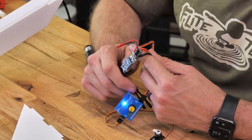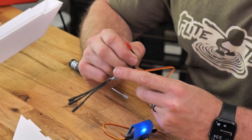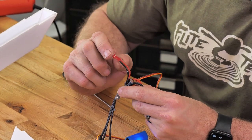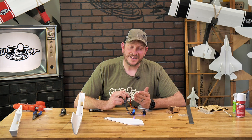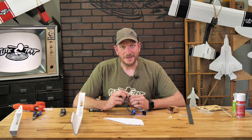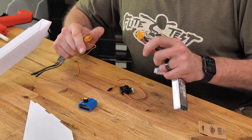Also, if you're using our Flight Test ESCs and you see this extra little lead, this is not BEC out — this is actually battery voltage out. If you put this as a battery voltage supply to either your receiver, your servo tester, or any other component that's not rated for that, it's going to blow it up. I always like keeping my servo tester handy because if at any point I move this accidentally, I can easily go back and recenter it.